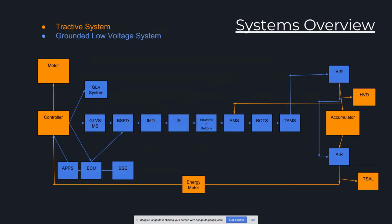You use the lithium-ion batteries to be the backbone, so to speak, or the big reservoir of energy. But in terms of short power, the problem with batteries is that they tend to have a fairly high ESR, so if you draw a lot of current from them, they only have a certain chemical reaction capacity, and so the effective voltage drops. To make sure that you can source current really quickly, use the capacitors, but if you need it for just the long haul, use the battery.